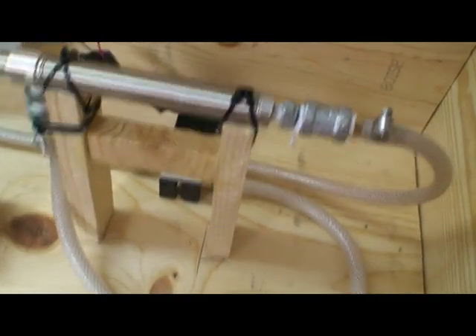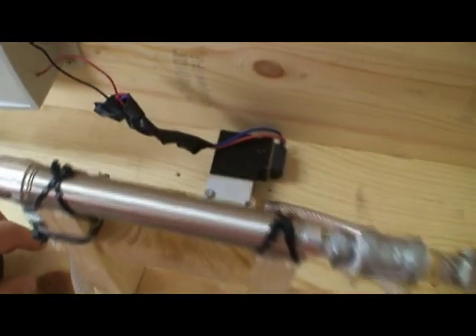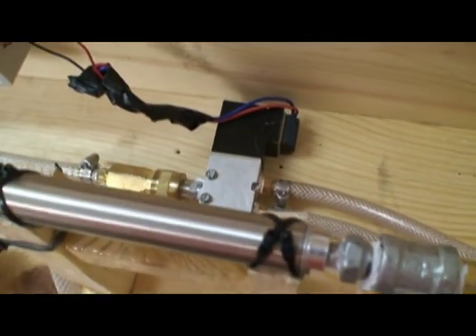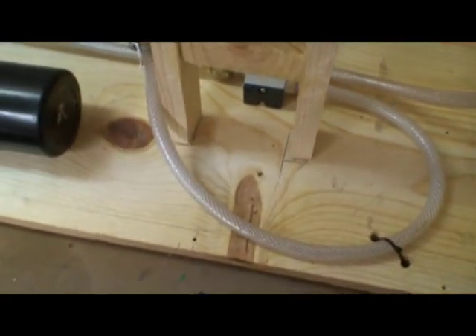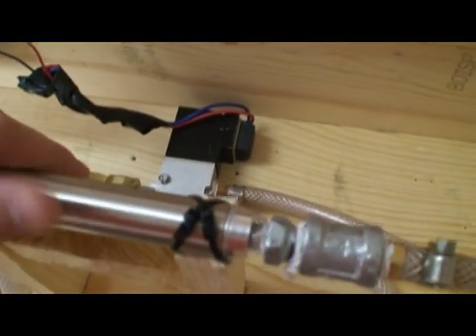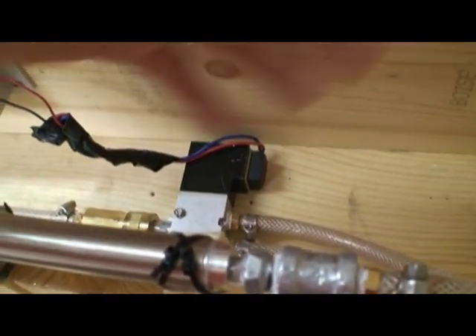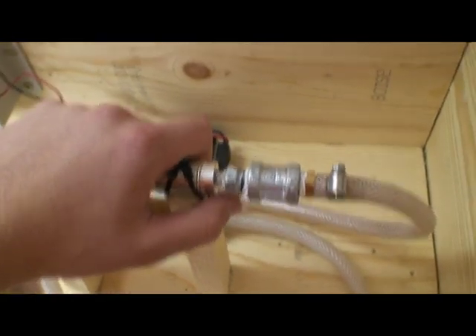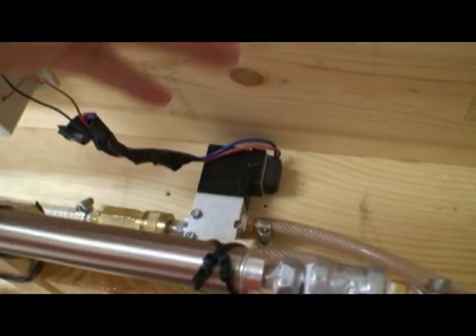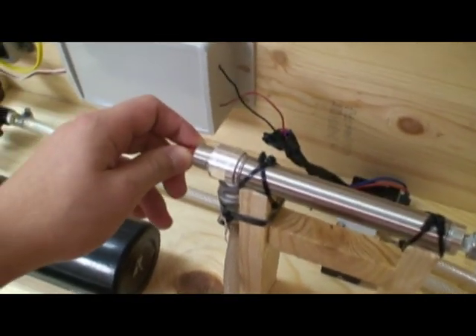I went with the large valve because with it you get the highest air flow — I think I can get 13 cubic feet of air per minute through this valve. Smaller valves obviously get less flow. With the large valve, you can always get a quarter-inch to eighth-inch reducer or whatever you need for your cylinder, and you get the highest air flow, meaning you can change from a small cylinder to a huge cylinder.